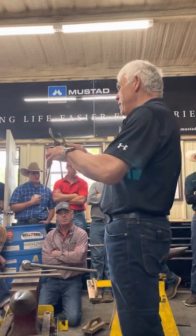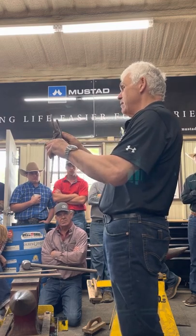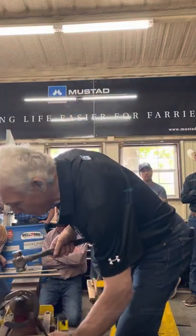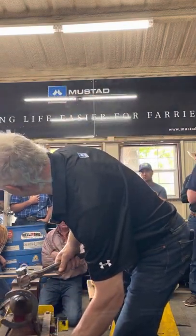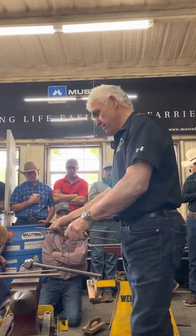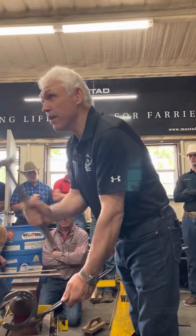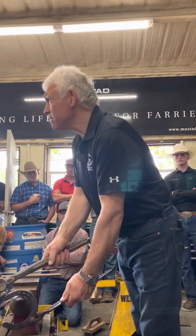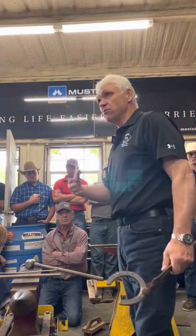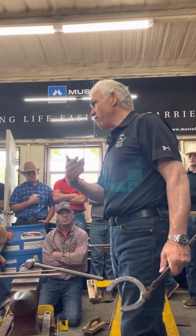How many times have you seen people dub the toe, shoe with that toe now? So, I'll hold it there. I want to bend the heel in. Look how I have to stand. Does that look comfortable? Or if I kick my tongs in exactly the same place and rotate them, does that look better? Okay? I'm always repositioning my tongs. Constant repositioning. Okay? Because good tong position will make me effective.